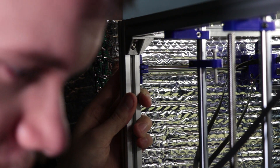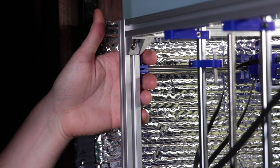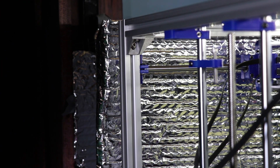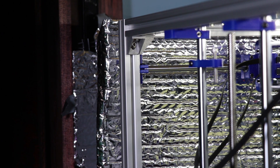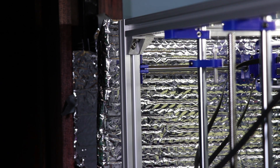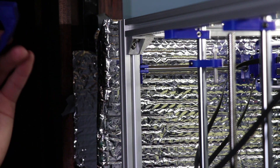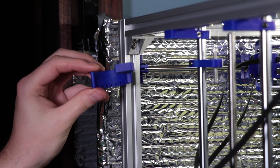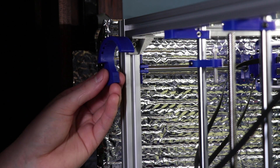I need to flip this around — loosen this little screw and two button head screws holding it to the frame, pull it out and flip it. I'll need some longer screws for this since the new profile is a bit thicker — going with 10mm M5 button head screws. A bit of a spoiler for the next video: I plan on turning these into a series and eventually releasing the design. I'll be going over how I designed the fan duct for the direct drive, since the first iteration conflicted with the hot end position. I need to swap it because the current one is pretty restrictive.